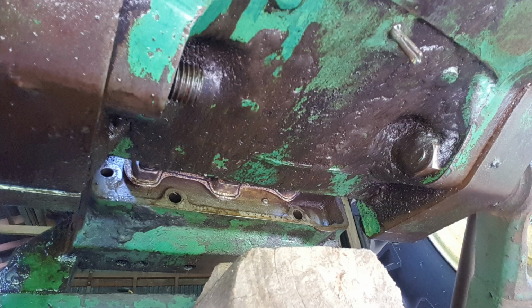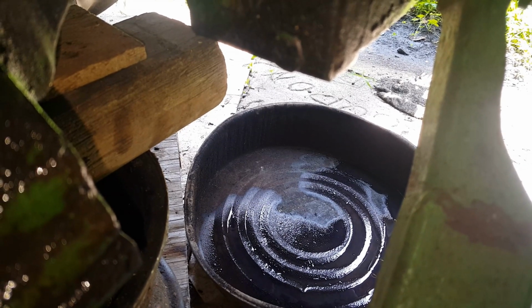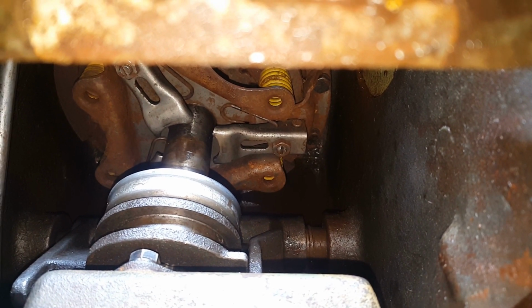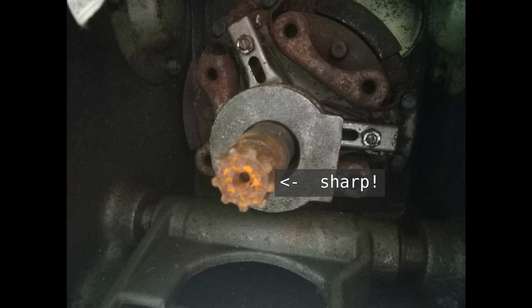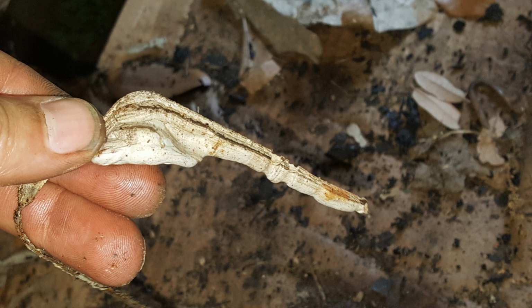We left a small gap between the PTO box and the tractor itself, so that I could get my hands down there and connect that pin at the end. But then when we put it all back together, I see oil is leaking out of the bottom, and so we must have damaged that main seal in the back where the drive shaft came through. But I'm just going to have to live with it, because I'm not taking this thing all apart again just to change that seal. And there are signs that someone's been back here before.